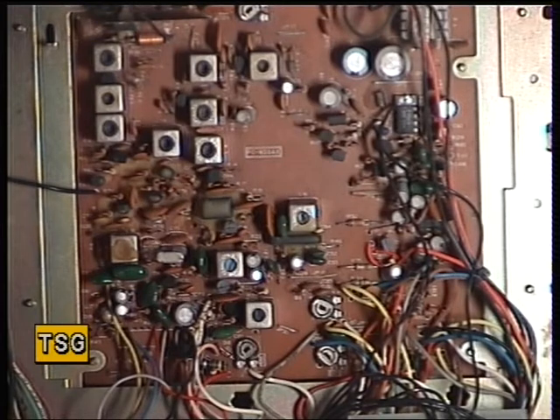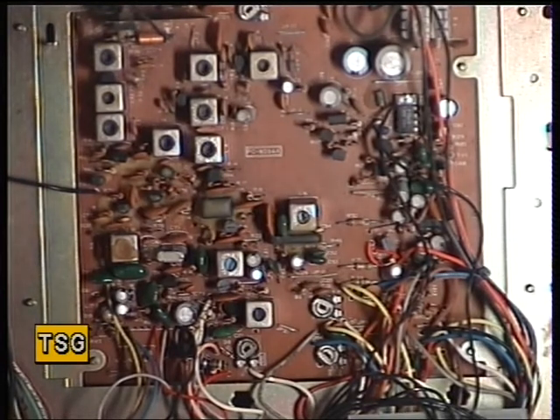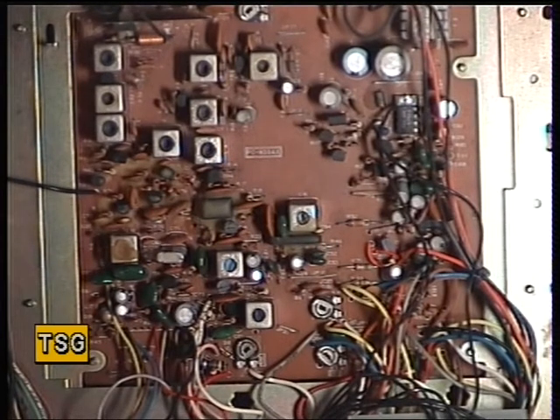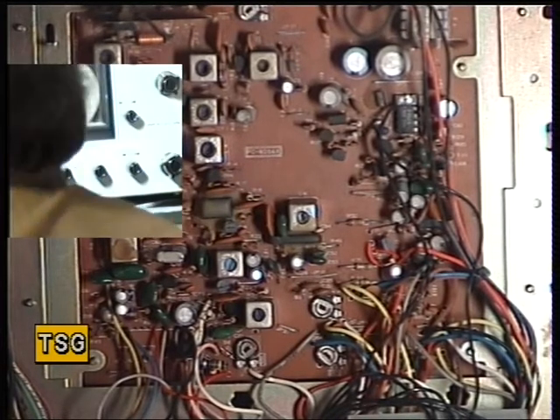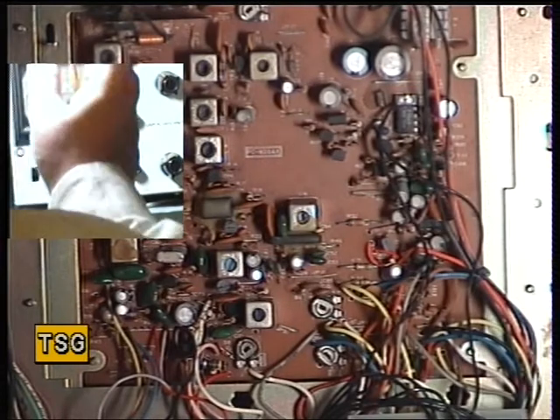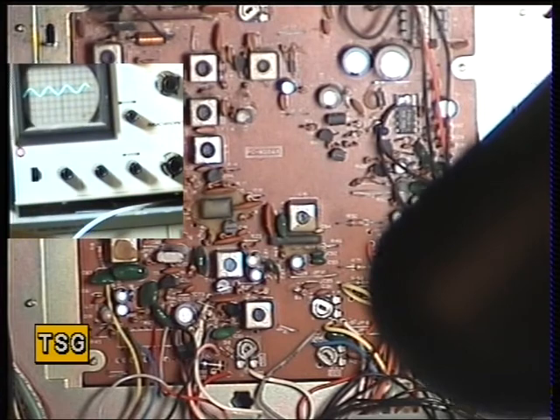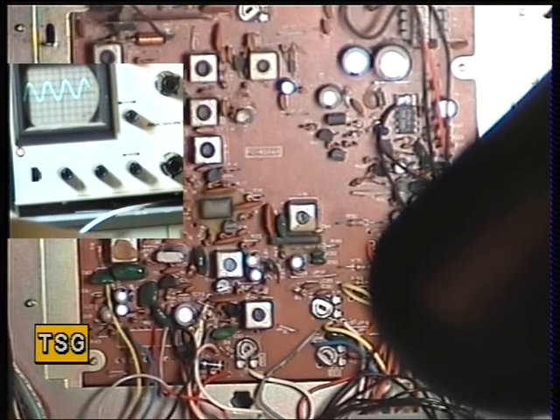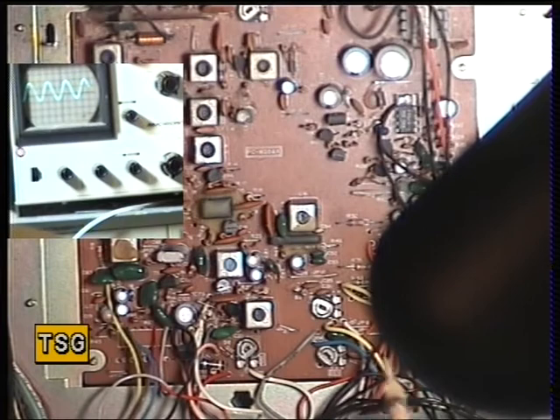It's not as good as some sets, but then of course it was made for a lower frequency. We'll set that to 100 microvolts for an S9 signal. I'll switch the other camera on so you can see the left-hand oscilloscope — I'll move my head and the light. I'll turn the volume up to get a better trace, and what we will now do is adjust the detector for maximum audio, which is L16.